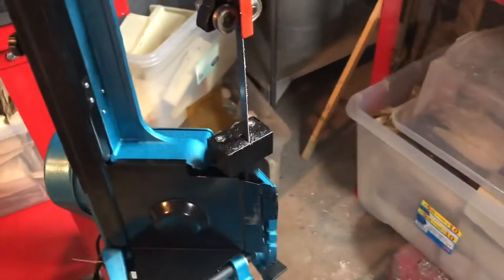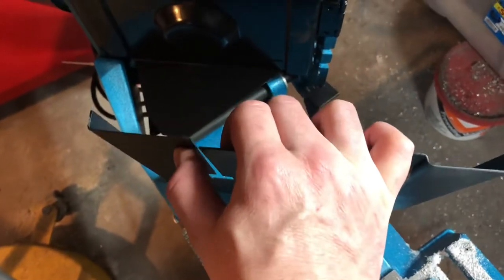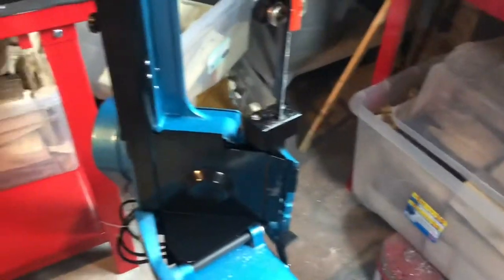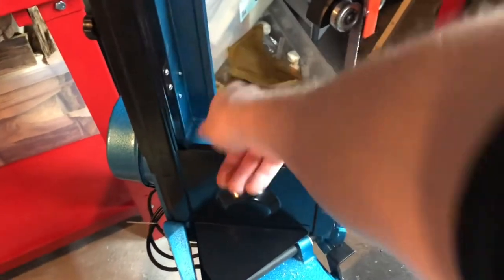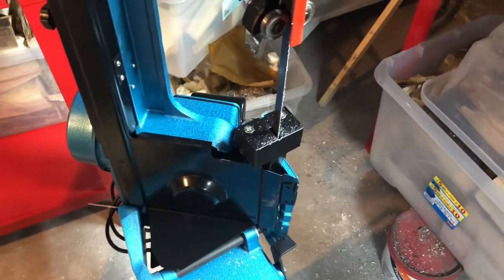But this metal plate is really, really weak — you can look at that deflection there, absolutely weak as hell, and other people have said the same. I'll probably replace it with a bit of 10mm thick plate and provide some drilled and tapped bolts into this bit or somewhere else, but I'll make that up as I go along.